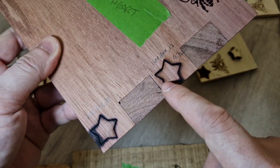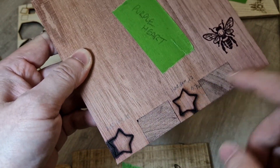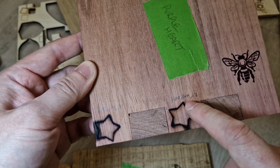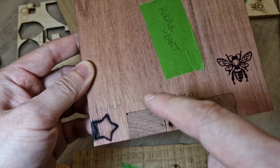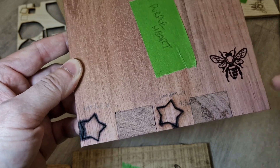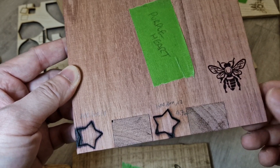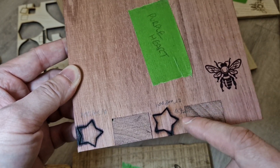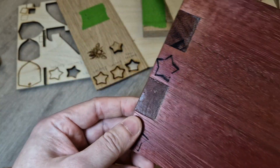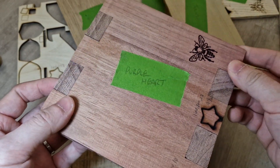As you can see, this is really burnt. To reduce charring and burning, you can use high power but very low depth — 100% depth means the laser moves very slowly across the path. If you use something like 30% depth and give it far more passes, like 30 or even 50 passes, you might get a clean cut, but it's not realistic or practical. So I wouldn't recommend cutting Purple Heart.